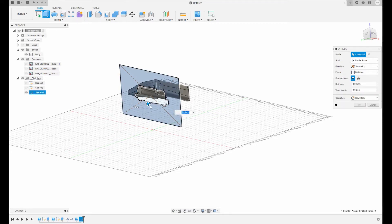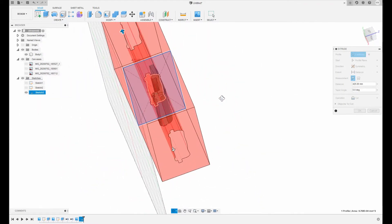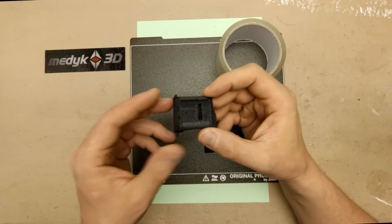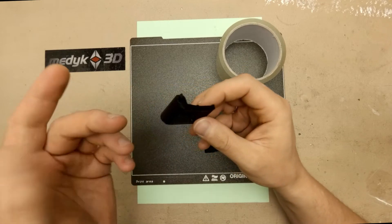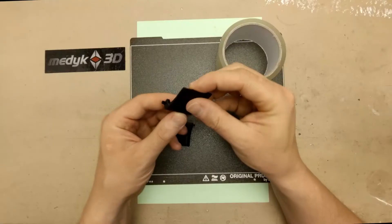As you can see, the end result is not perfect. I think it is because of how the pictures were taken. You really need to keep your camera as parallel to the object as possible, and the object itself has to be placed perfectly square. The first print was a test one using black PLA to check if the part fits. It has a really rough surface finish, but the most important dimensions look okay. So I printed another version and changed the orientation to a more vertical one, with supports added.